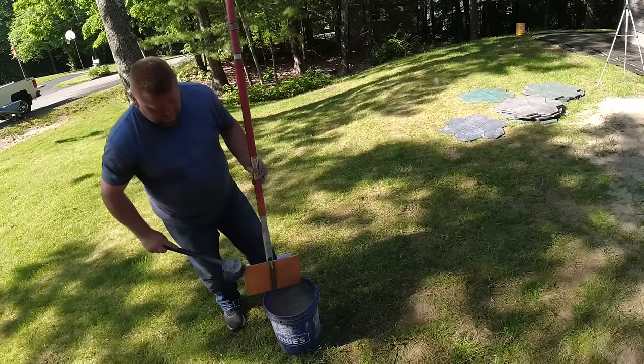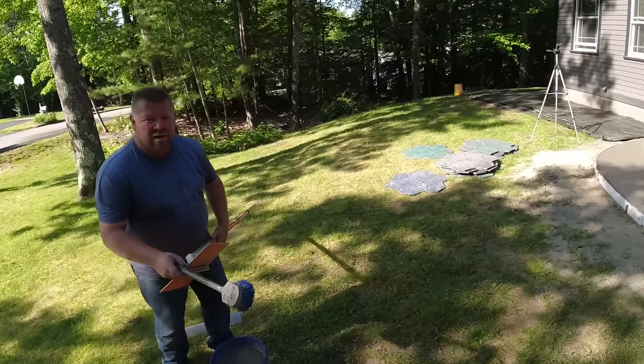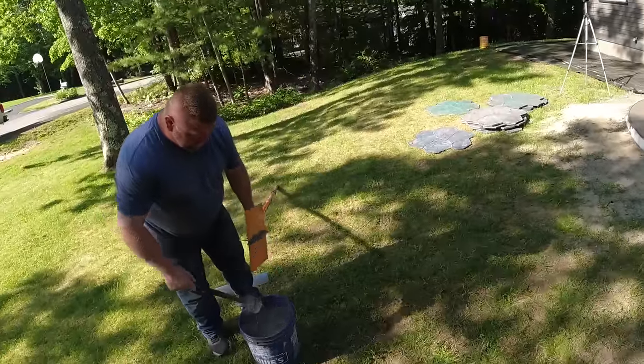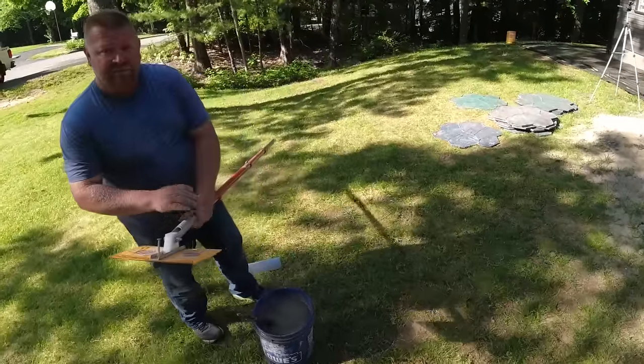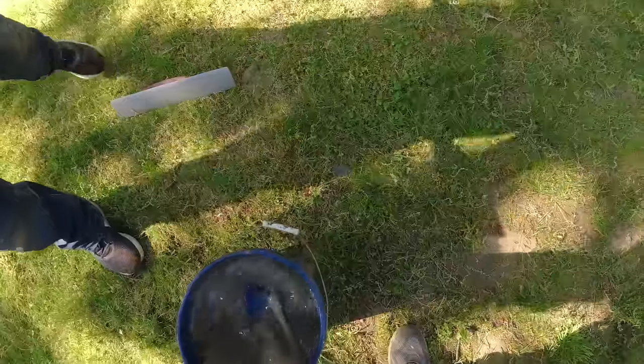Yeah, what'd you do? Did you put rubberized stuff? Yep. Well, it's not really rubberized, but it's an acrylic coating, that deck coating. Yeah. Went on good. It was all in the shade though, so it took about an hour in between coats. Probably kind of helped me though.